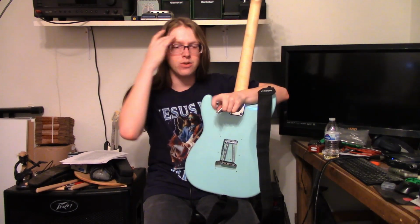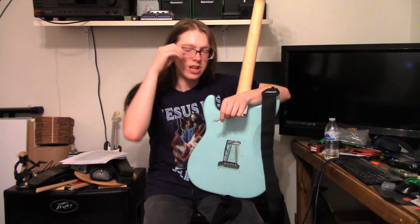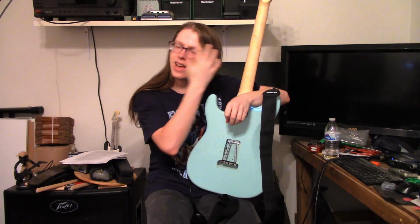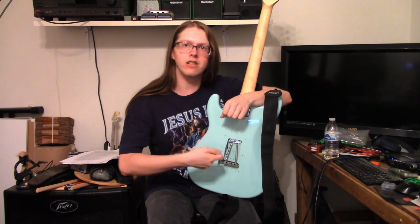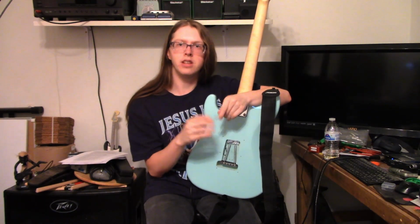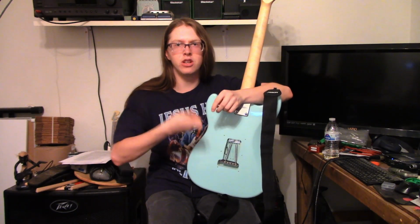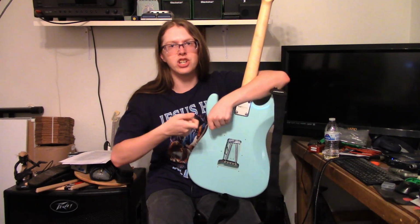I got it out using a technique from a video that I will hopefully link in the description. Basically you just try and lift out the hook side on the block with a flathead screwdriver, and then you try and grip underneath and on top of the hook of the spring with needle nose pliers. And then from there, I even had to use a combination of the needle nose pliers and then the flathead screwdriver to leverage it out.